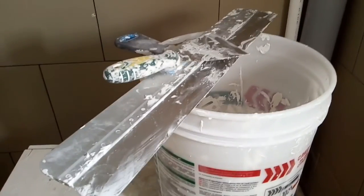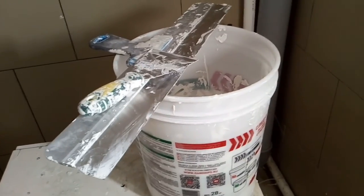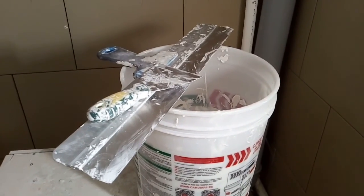When I said that plaster and putties need to dry out — I lied, I deceived you. They will crystallize. And so will your instruments. When you work next time, crystals will scratch the walls and react with your mixture, making it crystallize faster. You will have to throw it all away and buy new plaster. So please wash your instruments if you don't want additional expenses.